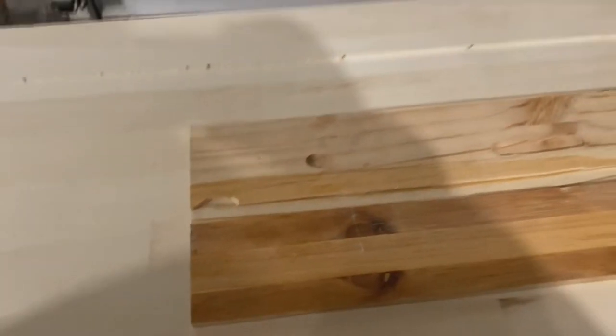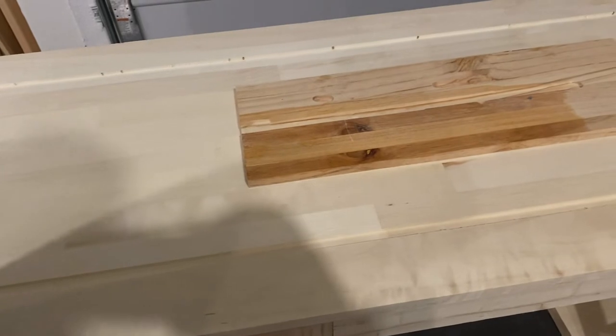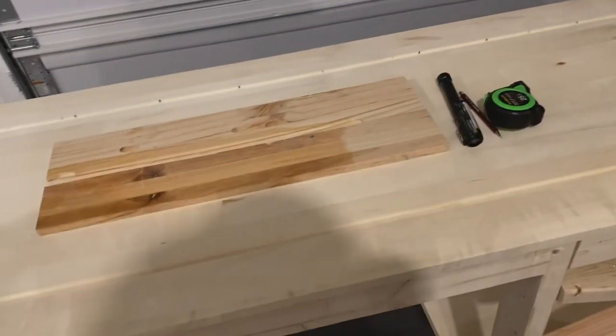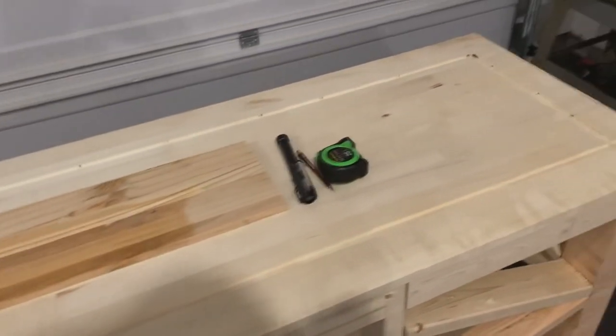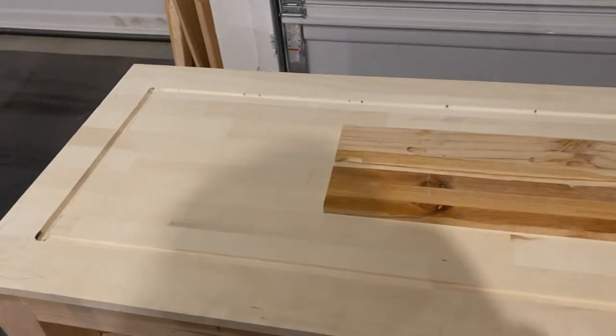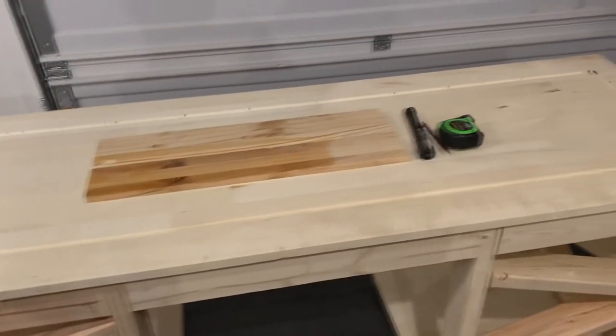And there's all kinds of pictures you can look up online telling you which direction to cut, and a right-hand rule with your thumb, and all kinds of things like that. Just work your way through it. Always practice before you cut, and you'll figure it out. But it is really important to make sure you cut against the direction of the bit. And so until we get back and pour that epoxy in there, the tabletop is done for now.